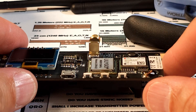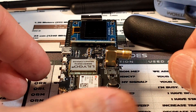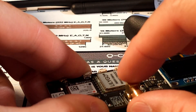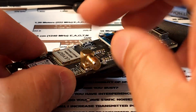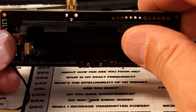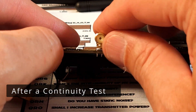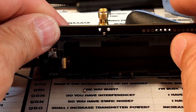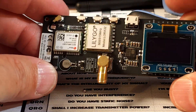I'm just trying to attach those ground pads — those four ground pads — trying to give it something that's going to give it some stability. It actually feels pretty solid. I'm going to test it and make sure I'm not shorting that center pin. There's no short between the center pin and the shield, so that's good. I still have good continuity between the center pin and that metal pin that you can see underneath.